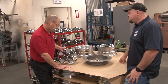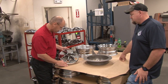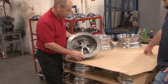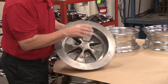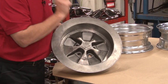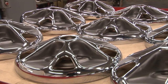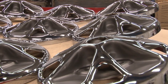After chrome plating, the next step is painting. They use a paint mask and a two-part water-based epoxy paint. It sticks extremely well — in fact, when they need to strip the chrome off after a mistake, the chrome stripper can't get the paint off; the chrome comes off easier than the paint. The paint is available in two colors: early argent for early wheels, and charcoal for later wheels. After painting, the wheel gets pressed into a hoop.